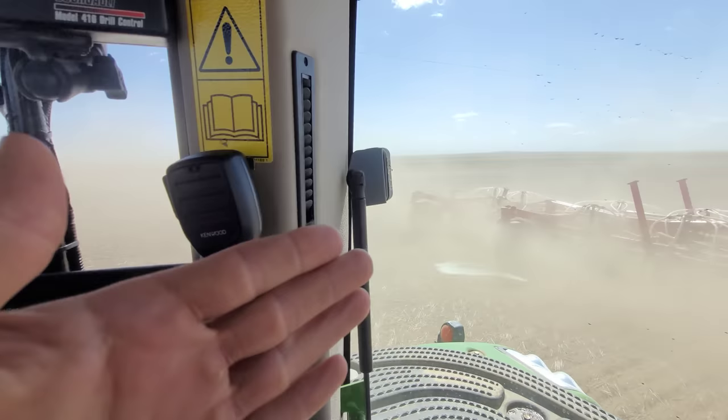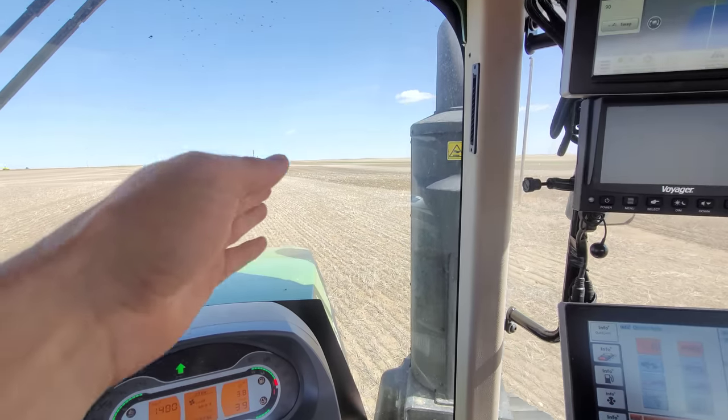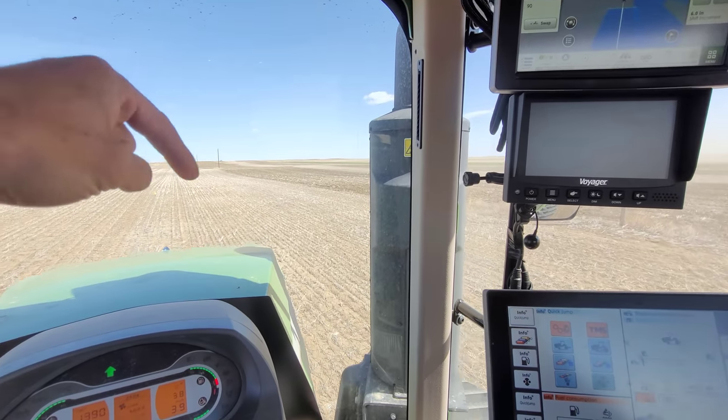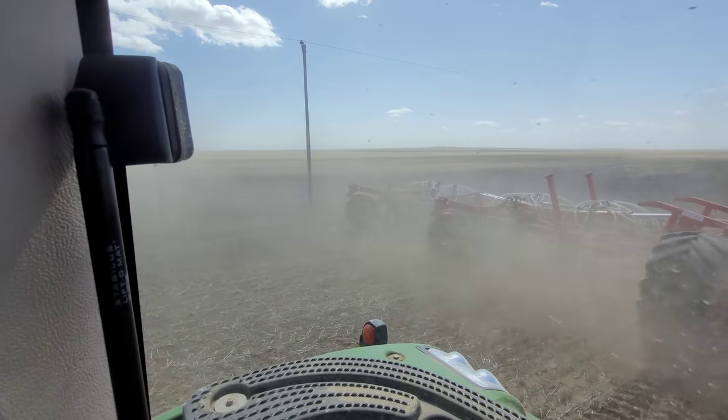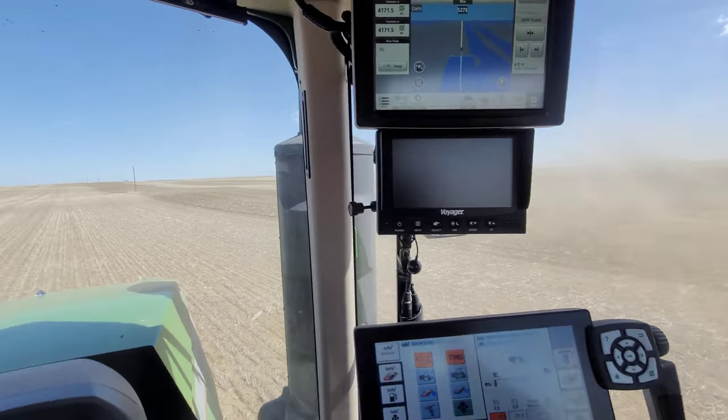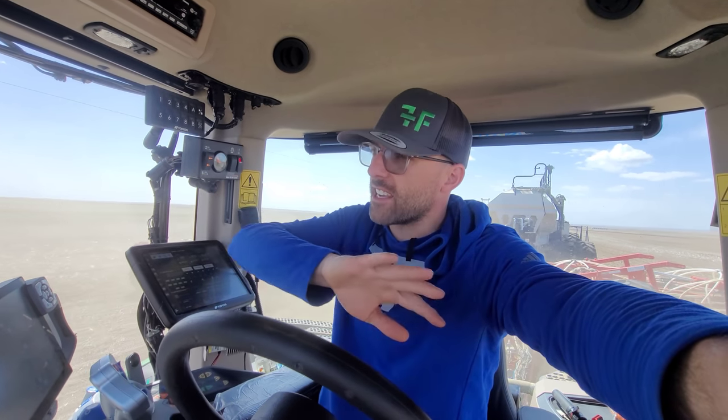We have a wind coming out of the west and it's blowing pretty hard. So when you stitch, when you make your first pass going around the poles, you start on this side because you want to work with the wind. Wind is normally your enemy when you're spraying, but you can actually work with the wind and make it your friend. When you're spraying, we would be stitching on this side - when you're actually making the physical move around the pole, this is basically just our cleanup. So you stitch it on this side and let the chemical drift past the pole, and that will give you more area - you won't have to get as close when you do your cleanup pass.